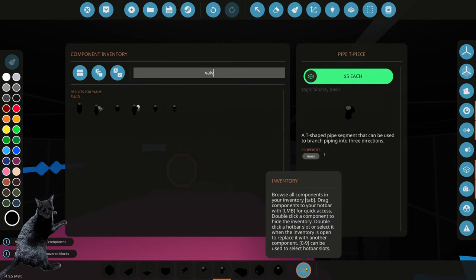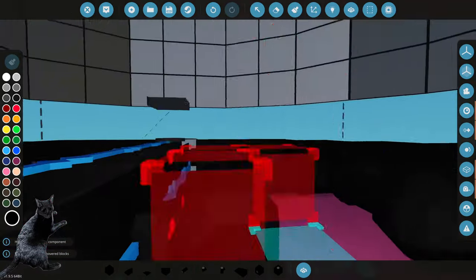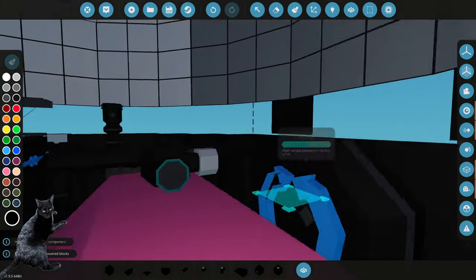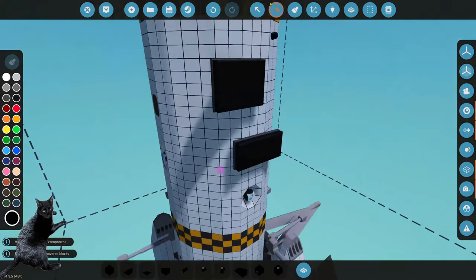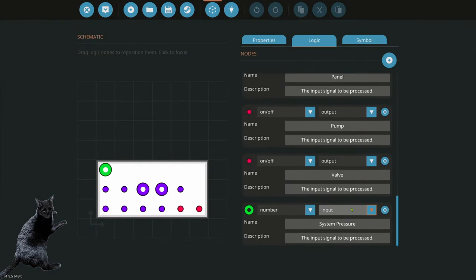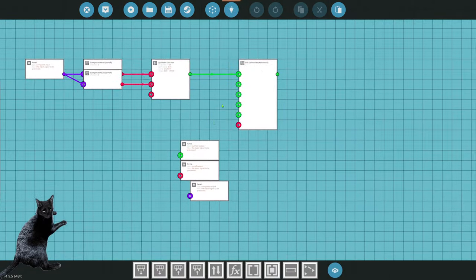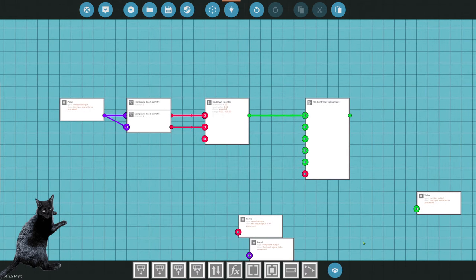And I think I'm going to start doing this with some of these valves. It goes so fast, I don't even know if this is going to help, but for example, if you set the maximum on that pressure relief valve to like 0.01 might help. So where's valve? Valve is going to be number output valve. And then that will pressure relief this out. And so we can PID control that.